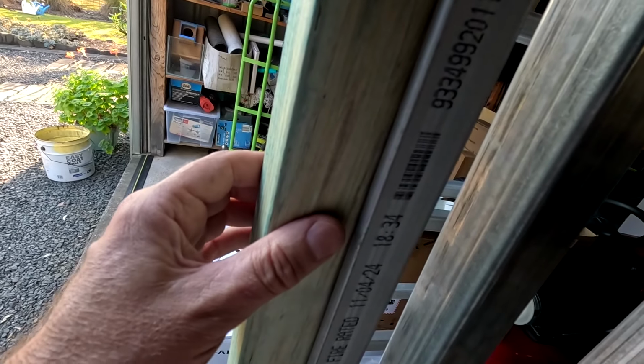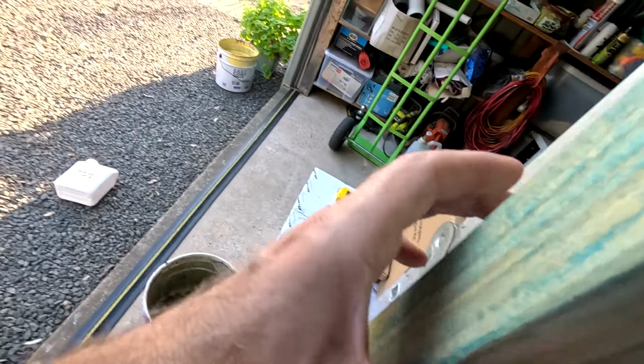Okay, I think I found a solution, but this does not involve this wooden beam, which I actually bought especially for this task. Now, what I will do is I will cut a smaller piece of timber, which goes in between, and then we have the plasterboard sitting right and left of this wooden stud. So I can screw it in from the outside, and then just put the plasterboard in between, silicone, done. And here on the other side, it just sits on this wooden stud. And again, I can cut the plasterboard on one side and then fold it so it has a bit of a kink in it. It is just minimal to get us from this wall thickness down to this wall thickness. Probably 10, 12, 15 millimeters the max. And I don't think we will actually see it afterwards. But I don't know, let's see.